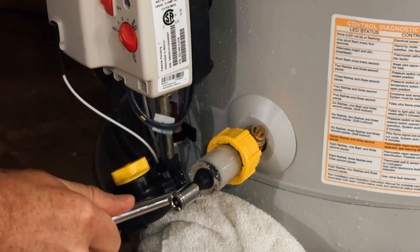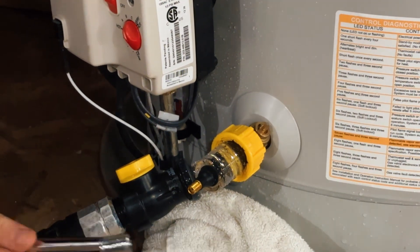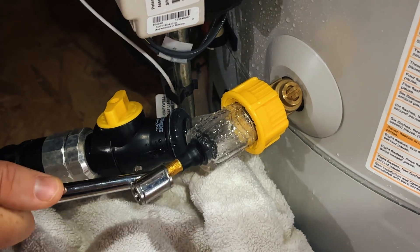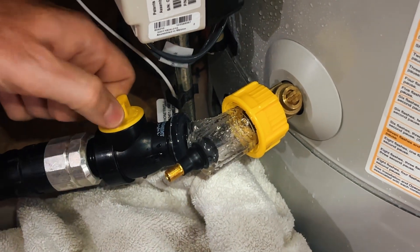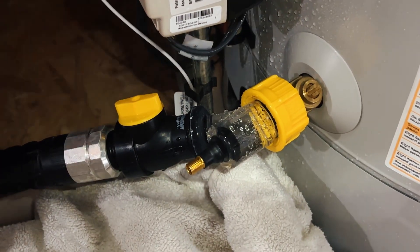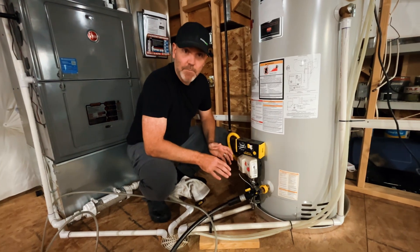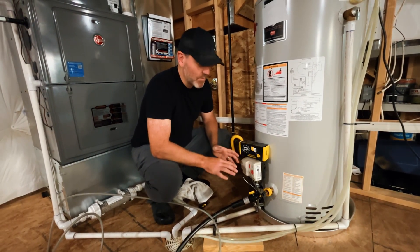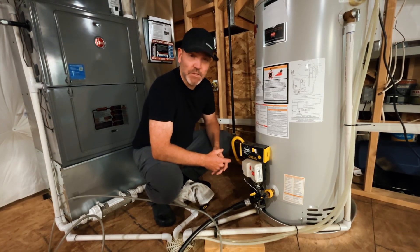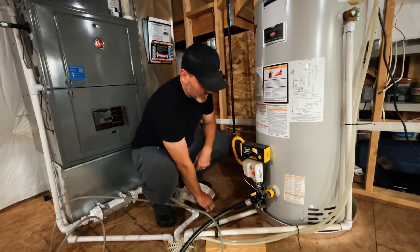What's happening is air is being forced in and right back out, disrupting any remaining sediment at the base of your tank. We've been flushing this tank for about 10 minutes and I'm feeling pretty good about it. In some situations you might find there's so much sediment that you'll actually want to drain the tank completely — we have additional steps and instructions on how to drain the tank empty.